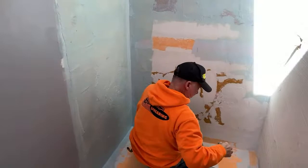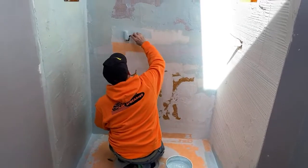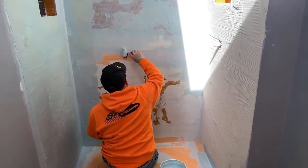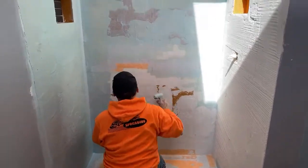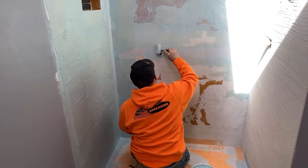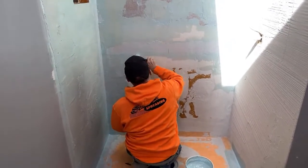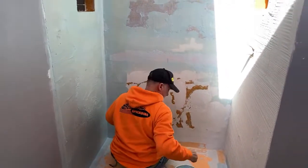So we are putting down Mapei AquaDefense, a liquid fluid applied waterproofing membrane, over Schluter Kerdi. Shower board is waterproof too, isn't it? Yes, that is waterproof too. But double warranty. But I disagree. I don't think it is waterproof on your seams and the banding that you put down. Right, the main board is. But your seams and all your penetrations for your fasteners, that's not waterproof. That's a porous material, and it can compromise it.